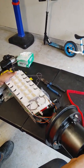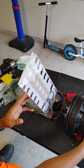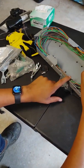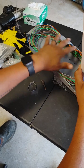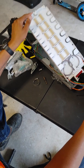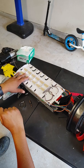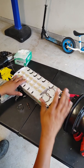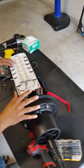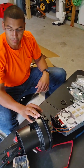Alright, so that's what a splice basket should look like — nothing in the middle, nothing tight, all nice and flowing around. Dead fibers on top for the ones you're not using, and all your splices right here. Then you put the top on the case and that's all she wrote. That'll complete building the Tyco D and putting it in the splice basket of the tray.